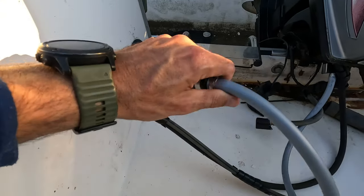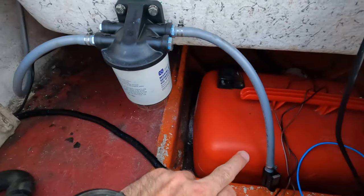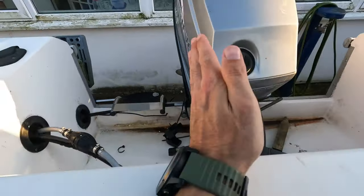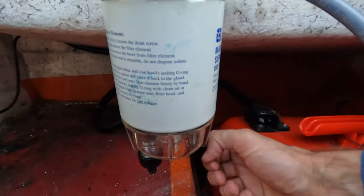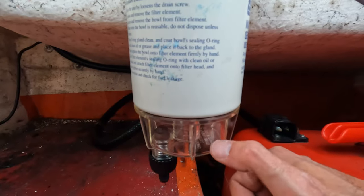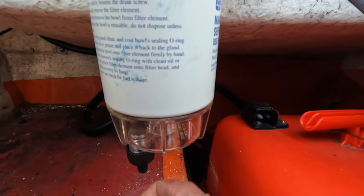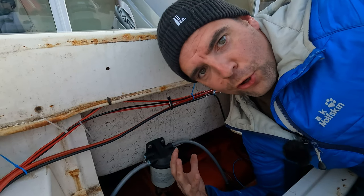There's a lot of discussion about primer bulb location when you use a fuel filter. Some people say have it between the filter and the tank, but I asked a marine engineer and he told me out here is absolutely fine. Plenty of room so the engine can still turn and tilt. You don't want to leave this too tight. Water is heavier than fuel so I'll be able to visually see any water in the bottom, and I can just drain it out. I've made it so nothing's going to knock it off — you can still open it up and drain it, which is handy.